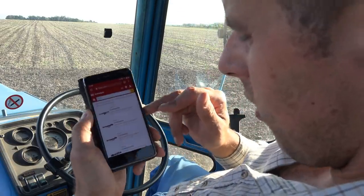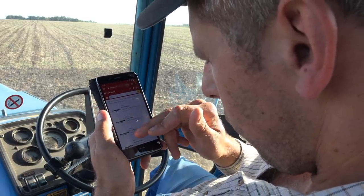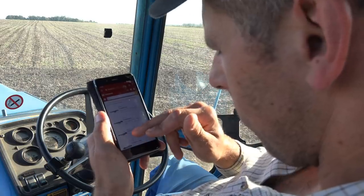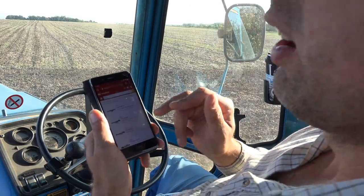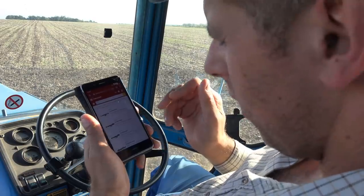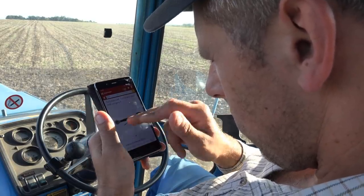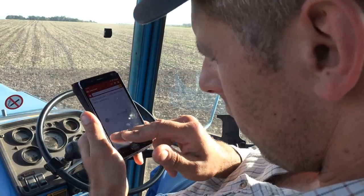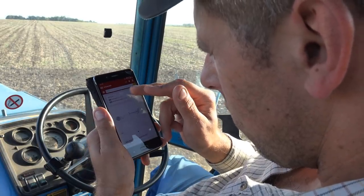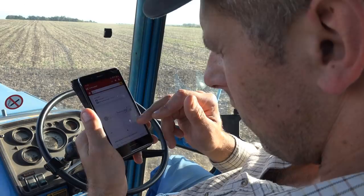What are these? They're all M36, all category threes. 400, 450, 510 - that's the only difference between them. I suspect that's the length of the body on them. The original broken one, pin to pin is 700. So we'll try this 510. Click on it and scroll across - it gives you the dimensions. Rod length is 510, minimum working length 710mm. So that is ideal.